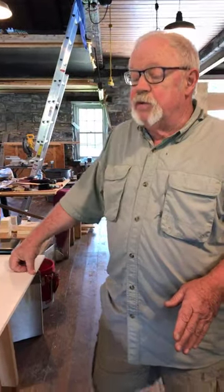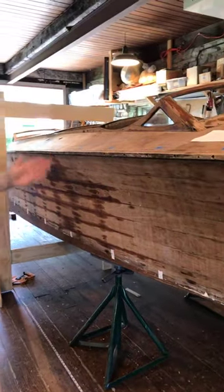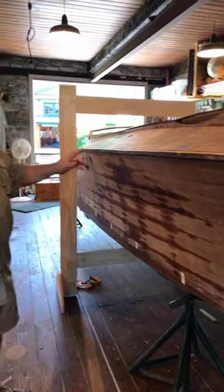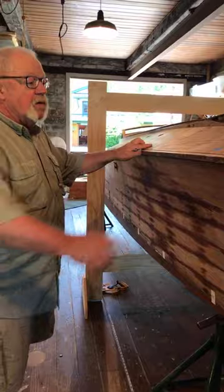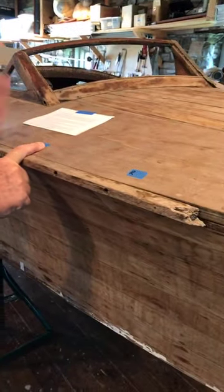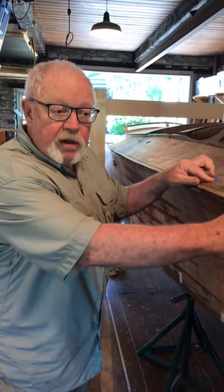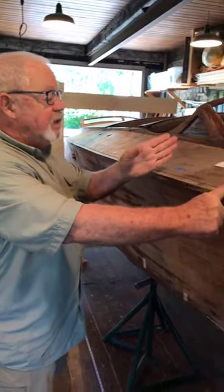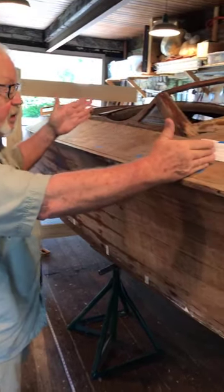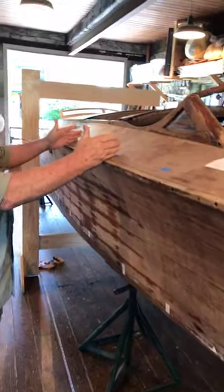One of the things that we do is take a full-size measurement at certain places along the boat. In this boat, it coincides with every sawn frame. So I find them, I label them. Every other frame in this boat is a steam bent rib, but we don't need to see it quite that often. So we did it every station, which is roughly 2 feet.